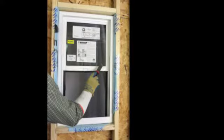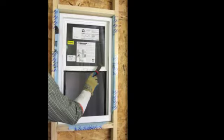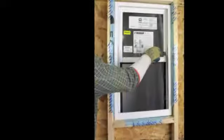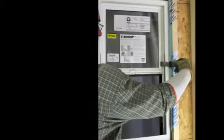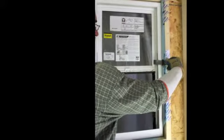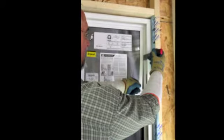The removal of the glazing bead which secures the glass in the upper portion of the 1500 single hung window must be done in the proper sequence to ensure the unit is not damaged, or more importantly, an injury does not occur. In this illustration, we began on the right hand side vertical glazing bead, though you may begin on the left hand side if you so desire.